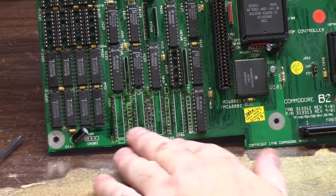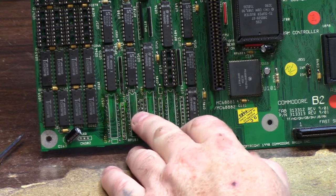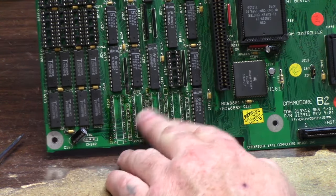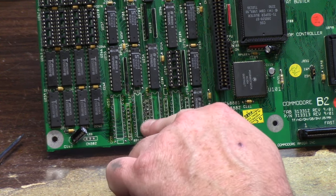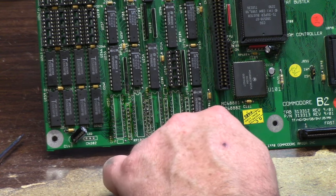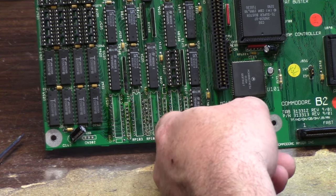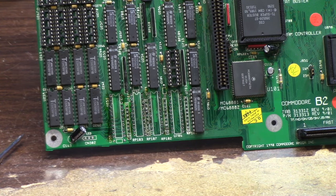Down here, these 74F646s, I bought a whole bunch of. These still have pins in them that were just ripped out. I'm going to clean this up with some desoldering braid and pull these apart. This is what's left of a resistor pack, resistor pack, resistor pack. They just obliterated it. I don't know why they just cut them out. Don't know the story. We're just here to savor.